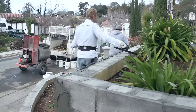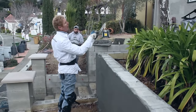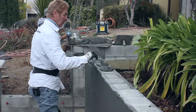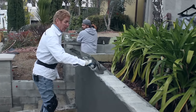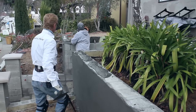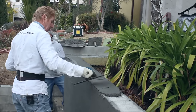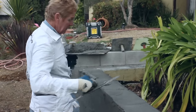Generally I'll take my trowel and pull it right off the top because we want jagged tops to match the jagged finishes of the original. The house has one finish, the retaining wall has another. I'll put some mud right here — you want to put enough mud up here to still give the jagged look and give you a top. What I like to do is pyramid it — go this way, go that way, then hit it flat. Now you can jag at your corners. I'm squeezing a little bit of excess and hitting it, getting about a half inch on these corners.